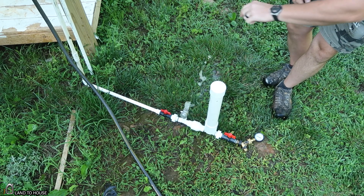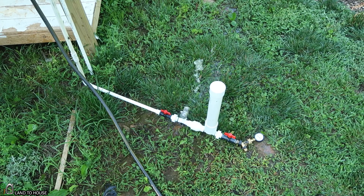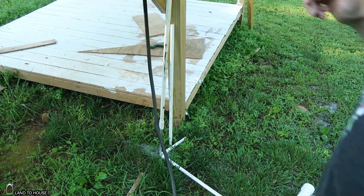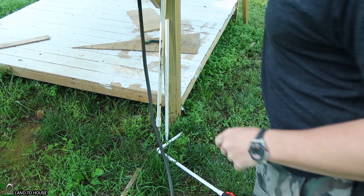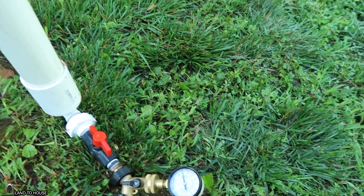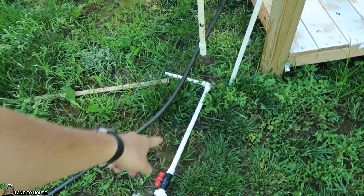There we go. I had 64 cycles in 40 seconds before my drive pipe burst loose, and the pressure in that 40 seconds was 20 psi. So maybe we should just work with that number for now — 64 cycles in 40 seconds, pressure was about 20 psi. As you could tell, that was cycling very fast. So if our spiral can slow that down, then we will be golden. I'm going to pull this off and keep this long piece, and we will see how well the spiral section does.